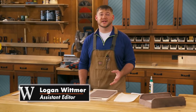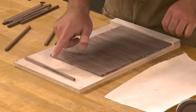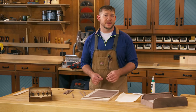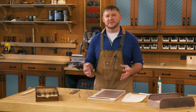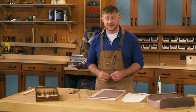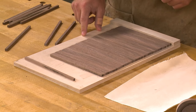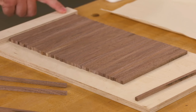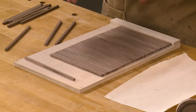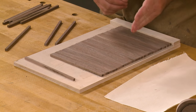To build the timber door, you really only need a couple things. First, you'll need your timber strips, cut from a hardwood blank planed down to size, then ripped to width at the table saw. Because you need a lot of these, batch cut them at the miter saw to a rough length and trim to final length later. Then you'll need a plywood sled — a thin piece of scrap plywood with a fence attached square to the back, because we'll use that fence registered against the rip fence on the table saw to trim everything to final width once glued up.